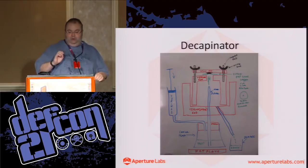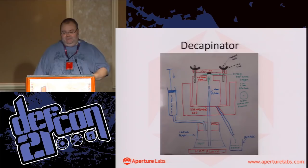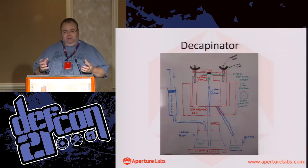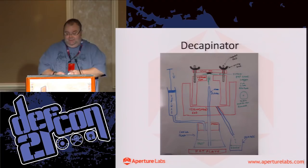I learned a little bit about pulling glass pipettes. It is simple, unless you want the pipette to be absolutely straight, in which case it's a pain in the arse, but it's doable. And I also wanted to be able to control where the acid was going to mask it into a particular area. So after a lot of research, I came across this gasket material called Viton ETP 600S.